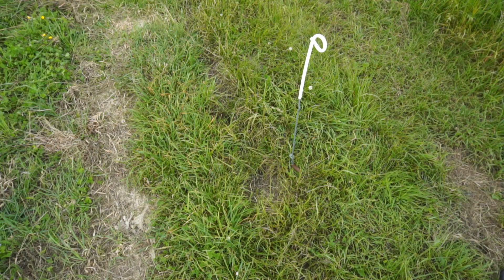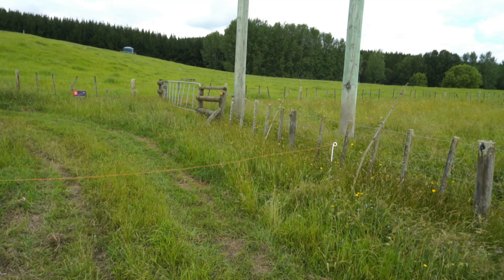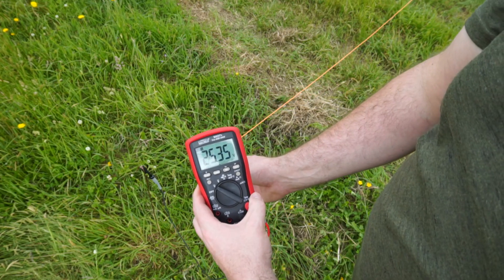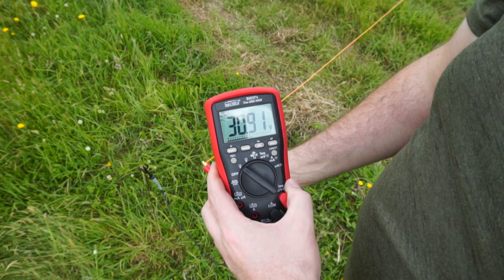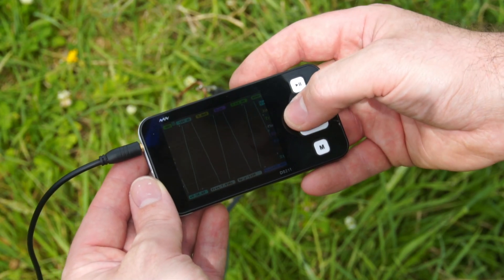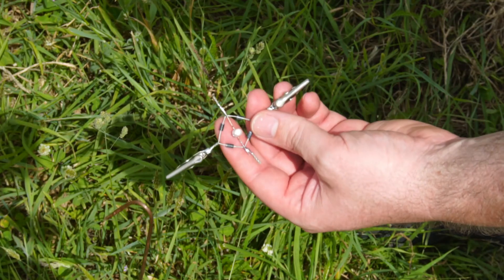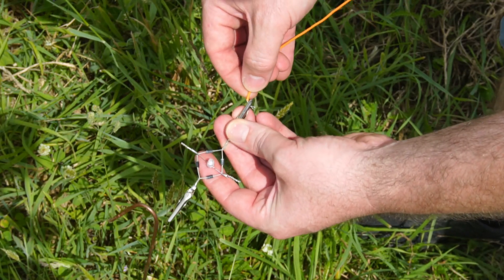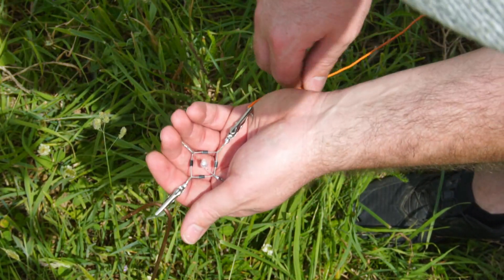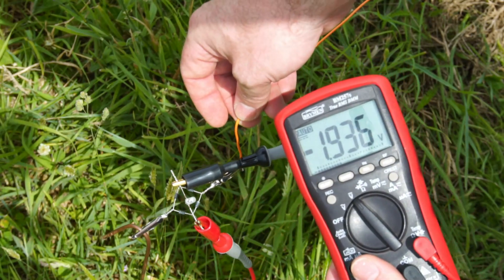For the experiment I wanted to see if I could capture enough power to illuminate the LED. To do this I strung out a short length of wire in parallel with one of the live power lines — the voltage was around 30 volts AC, not bad for such a simple setup. Out of curiosity I used my DS211 to inspect the waveform, and here we can see a nice 50 hertz sine wave. 30 volts is more than enough to run an LED, but the question is whether there's enough current. I connected the LED to earth and connected the other side to my wire — it's difficult to see in broad daylight but I couldn't see any visible light being emitted. I connected my meter across the LED and the voltage was only about 1.9 volts, which isn't enough.